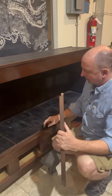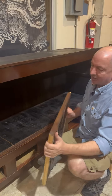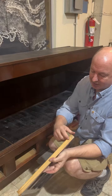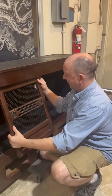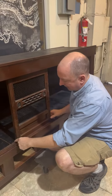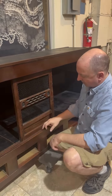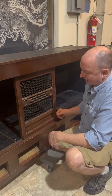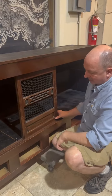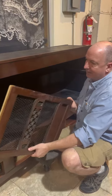When we lowered the track, one of the things that has to happen also is you need to cut this area out just a little bit deeper, because what's happening right now is that we're getting it hitting this section here — the raised edge. We want that just to be a divider; we don't actually want the doors riding on it. So we're going to have to cut the bottoms a little bit, get that notch a little bit deeper so that these doors will slide perfectly.